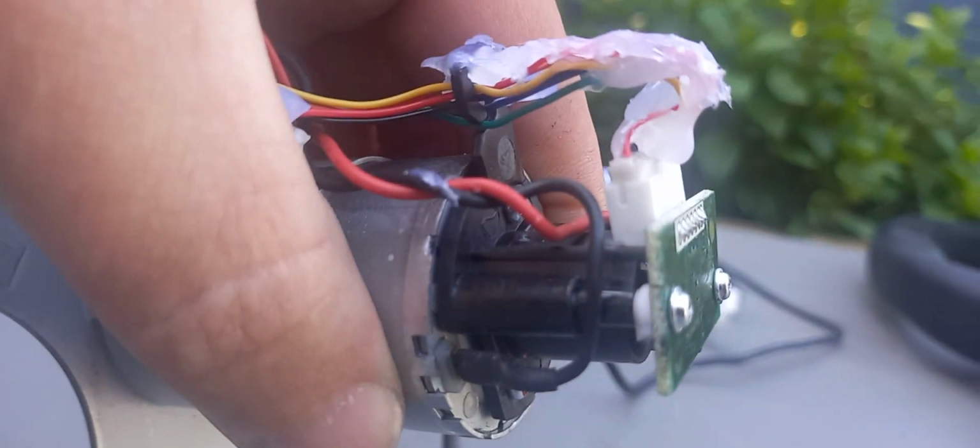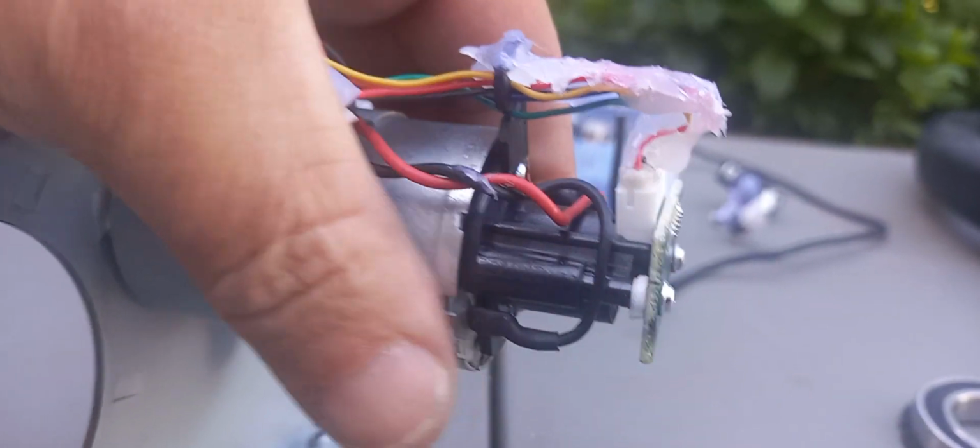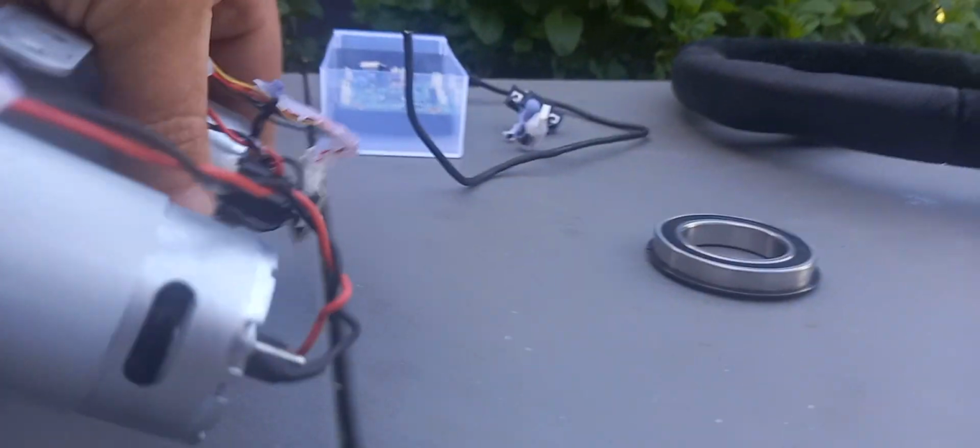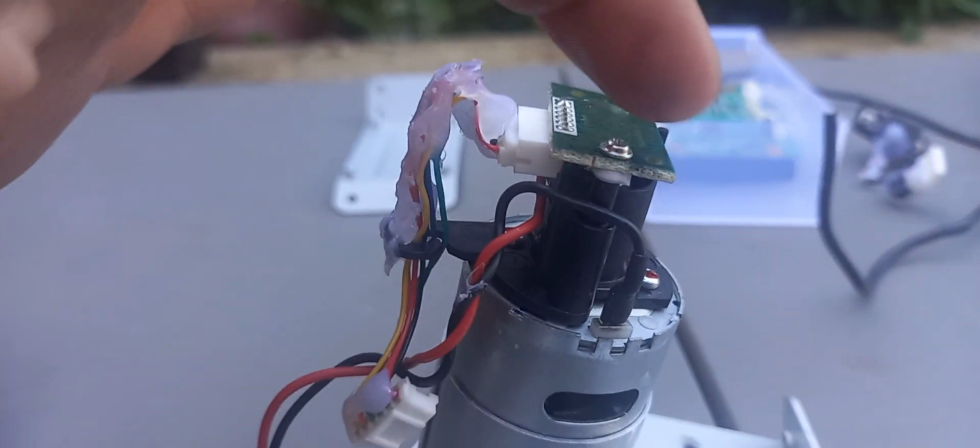They all do it, after you hit a wall too hard or give them too much grief. But if you just put a 0.5 washer there behind the Hall effect sensor, or in front of it, never drops out. Works perfectly every time, calibrated, perfect. That's the solution right there. Tighten up the motors, obviously, because they're never done up tight. And you've got a working unit. That's always the problem, this little bugger. They just forgot to allow that bloody gap.